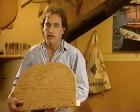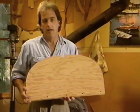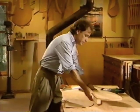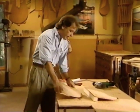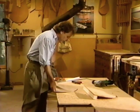The station molds represent cross sections of the hull. They are the foundation on which the boat is built, and accuracy in marking and cutting these out is crucial. The plans provide you with paper ones, but I'm using plywood ones here to facilitate the marking for this jig.